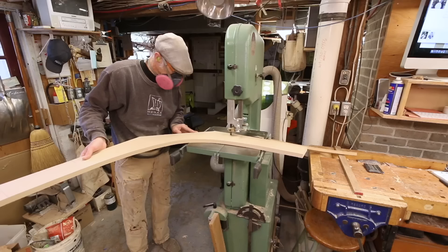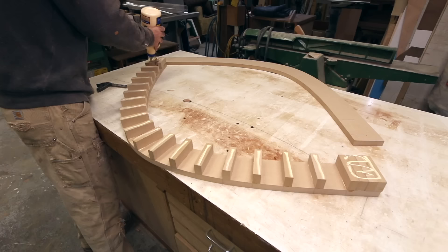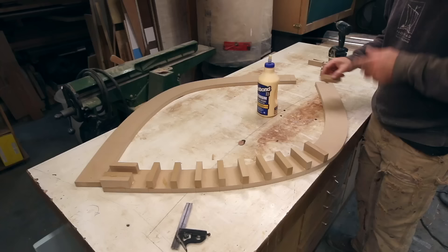I'm making what is essentially a solid mold — one that mimics the shape of the part with parallel sides and is generally solid all the way through. In this case, for economy, I'm just using little webs between two outer faces. The advantage of a mold like this is you can do a lamination on it and move it to a different part of the shop very easily. The downside is it uses up some material and takes time to fabricate.